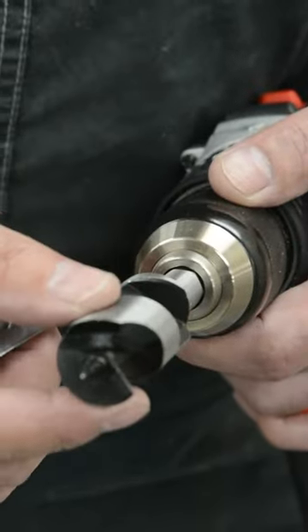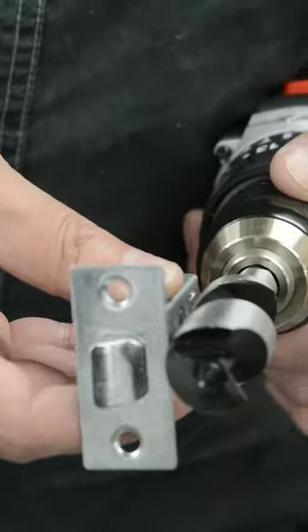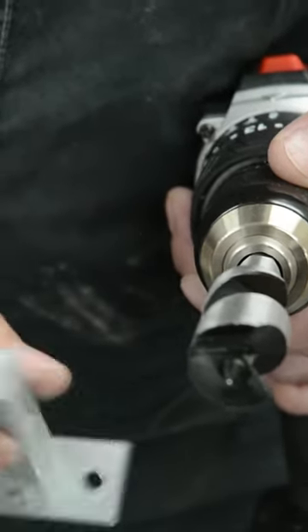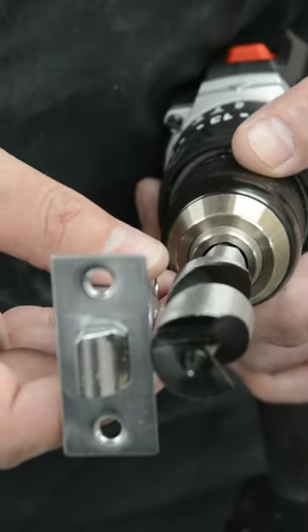The idea is to use a stubby auger, which allows you to take it in or out of the chuck accordingly. Using your latch or lock as your template, set it up so that the back of the lock or latch is hitting what will be the chuck, and the front end gives you just enough depth for clearance on the bottom. Basically, when you drill it out, it bottoms out on the chuck — can't go any deeper, so you can't over-drill the hole.